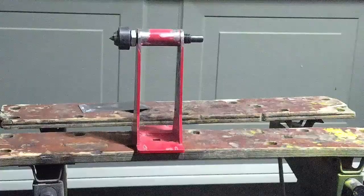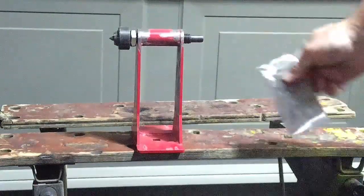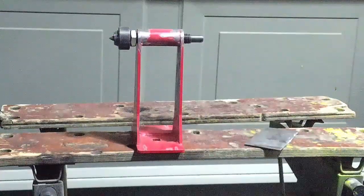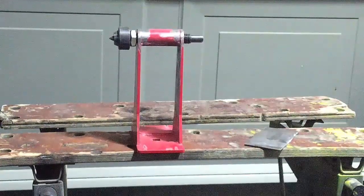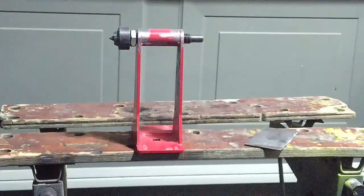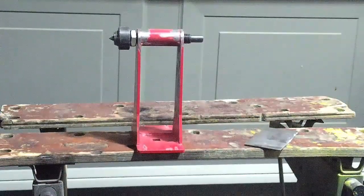So my thought, rather than throwing this lathe away like I probably should, I'm going to attempt to fix it. What I've done is cut out a plate of steel that I'm going to put vertically inside and weld it all together, hoping that it will act as a better anti-shear device for this tailstock. I won't be showing the welding since it never really shows well on video, but I will show the end result and report on how it works.